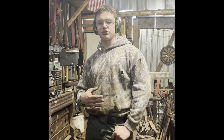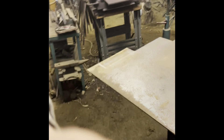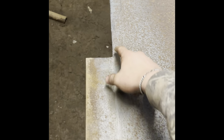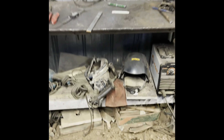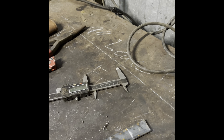I'm going to be using all the same material that I used for the last one, so I'll show you that real quick. Alright, this is a quarter inch plate, it's nine inches long, three inches wide, and then an inch and a half of this one inch square bar, and then two two-inch sections of this quarter by one inch flat bar.